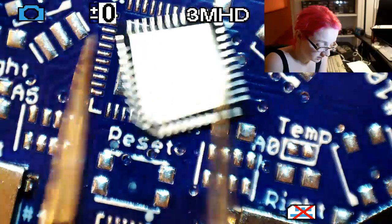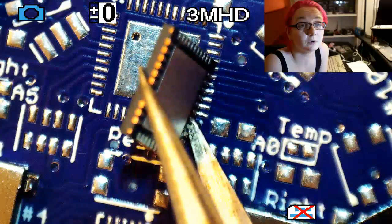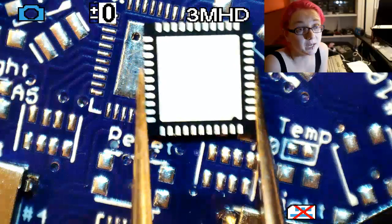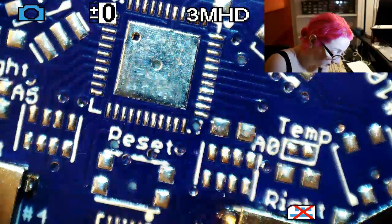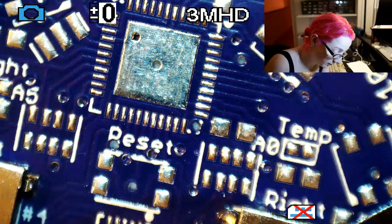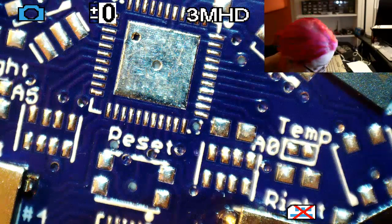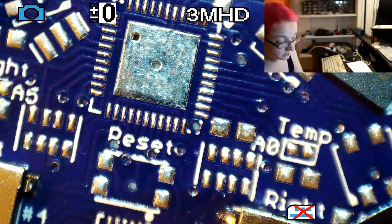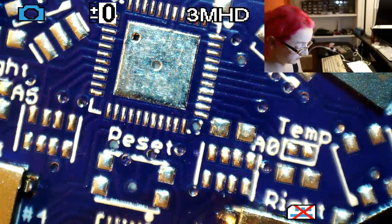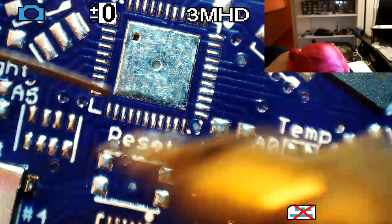The pins wrap around the edge here. You can sort of see the little gold glint of the wraparound. But you don't have to worry about any of the pads breaking off. But they're a little tough to solder. However, it's completely possible to solder them with just solder and a little bit of wick. I've done it. I might have to grab it and just kind of eyeball it, because even though this microscope is very good, it's tough to angle and keep stuff in focus.